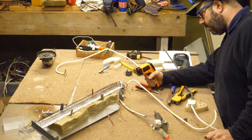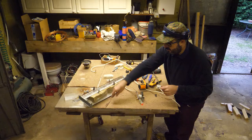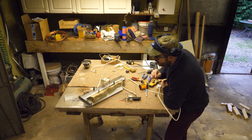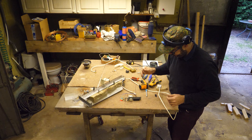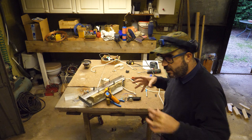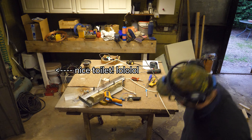That is showing 500 degrees centigrade halfway down those tips, so this is probably just a thermostat controller. This would kind of come on, off, on, off depending on what that reads. I think this might do it — if I can make this into a lovely curve and put the thermostat safely above the element. With this on/off mechanism, this little heater — if I can build it safely — will give a certain amount of energy into this furnace every half an hour, in short bursts: really hot, nothing, really hot, nothing. But overall that will even out. So it got to 20 degrees centigrade, and now it's turned back on again and the probe is quickly warming up: 40, 41, 42, 43, 44 — and it's switched off.